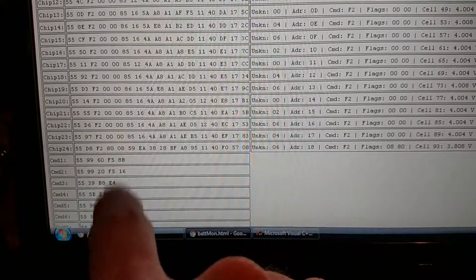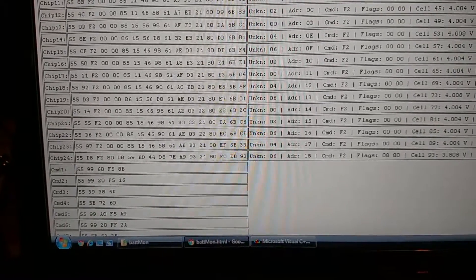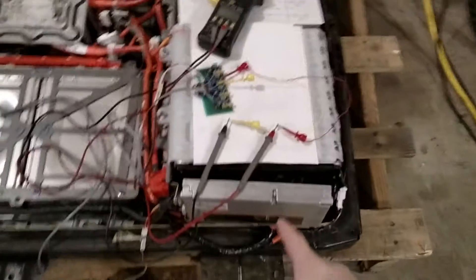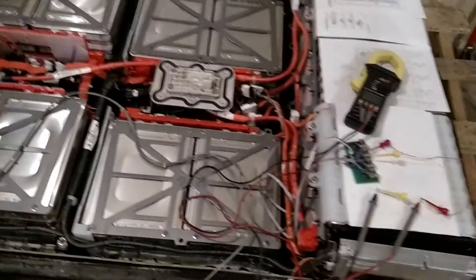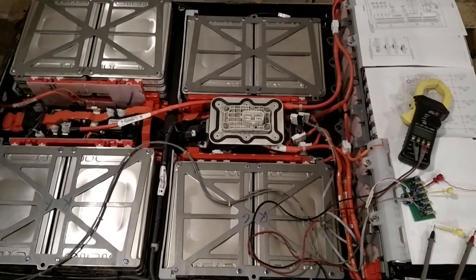Progress is being made — not too shabby. Once we get all that worked out, I'm going to go ahead and replace their microcontroller with my microcontroller. Once I know what all those commands are, I can send them and command this directly — pull out the chips we don't need or just bypass them, and be able to configure this from a 48-module to a 40-module to series strings of 20 in parallel to put in the truck. Anyways, that was a really long video — if you waited all the way to the end, thanks for watching. Bye.